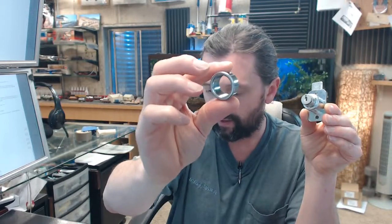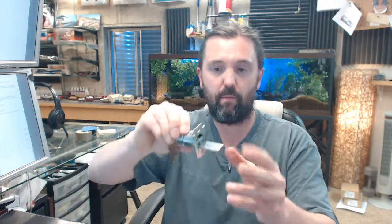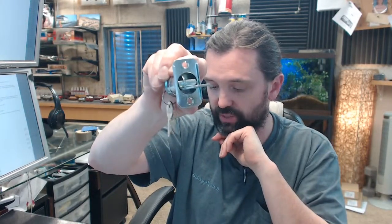Step 3 is to insert the lock shroud from the outside — that's just a trim ring that pressure fits into your wood door. Then bring your lock from the back side. It's non-handed so you can install it either way, however if you want the keys to go up, the tailpiece when in the unlocked position is vertical. You can remove the key in either position. The lock will mate up to your shroud, the two screws secure it here and here, and your installation is complete.